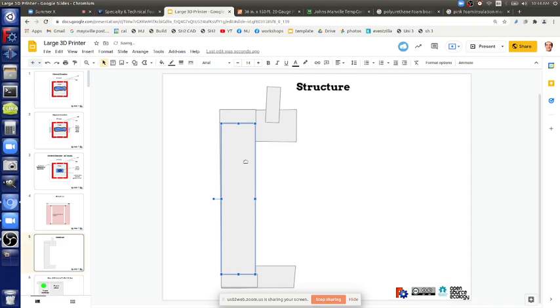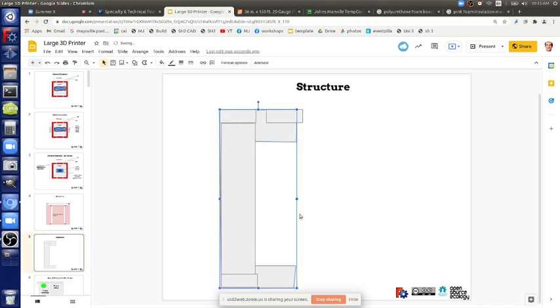So what happens to this edge? Are you insulating that? I just thought if we've got this as the inside of it, wrap around chicken wire first. Oh, yeah, wrap around it. On the inside, then put in your mesh, put in your insulation, and then put another layer of mesh over the top of it to hold it in place. So it's sandwiched twice, and then at the ends, you leave it sticking out so that you have a gasket of rock wool. Does that make sense? So are you saying, for the C, you've got another 2x here? Yeah, or I'd do it kind of. But this way you're getting rid of the wiper thing.